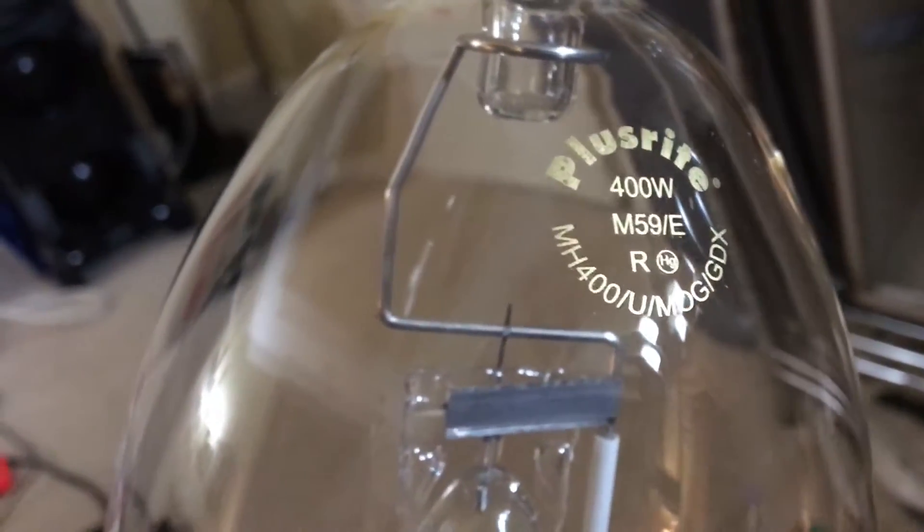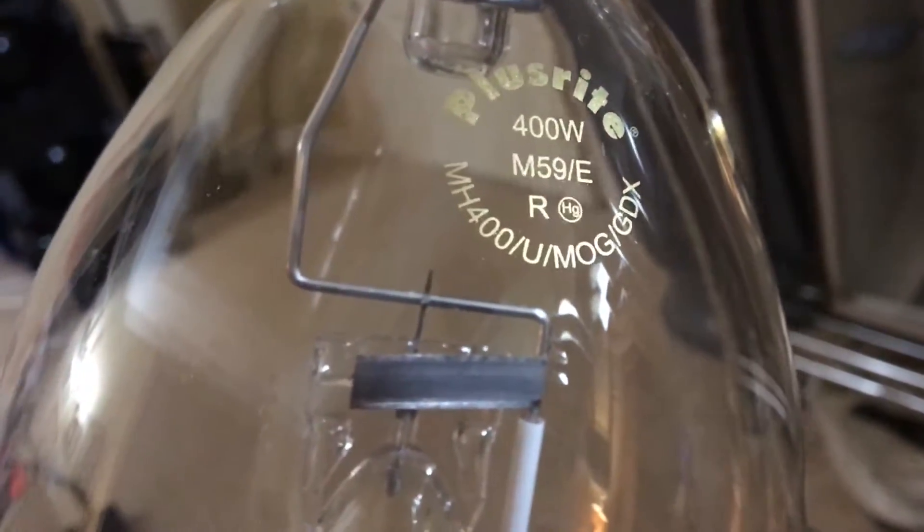Under it is the bulb code, and it's actually a kind of a complex one, but I'm a lighting enthusiast and I know what these bulb codes mean, so I can tell it to all of you. Starting from the left: you can see it's an MH400/U — universal burning position. I'll also be putting the burning position in the description below. MOG meaning mogul base, since I don't believe there is a medium base on an elongated dimple 37 bulb.